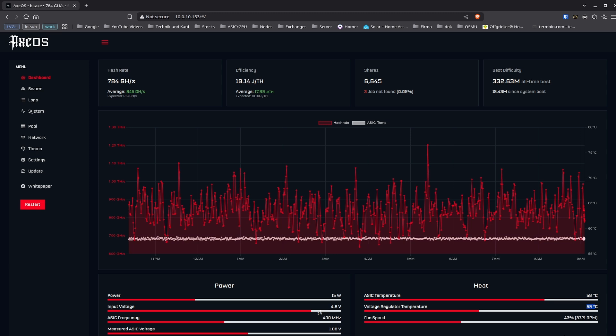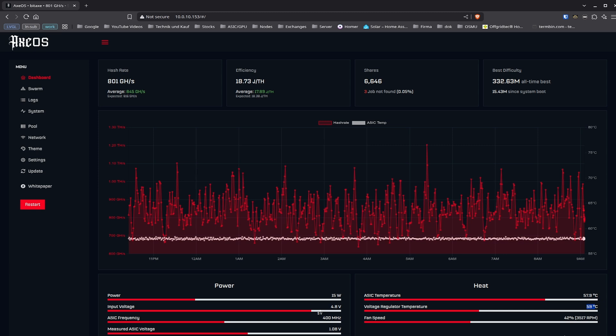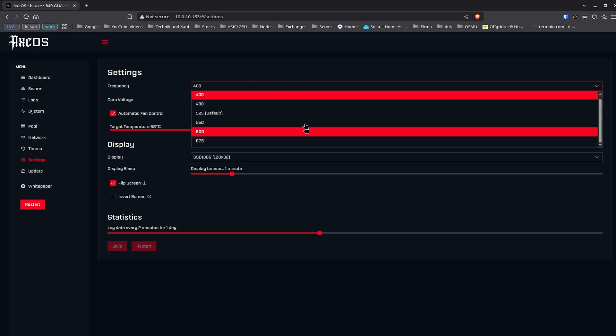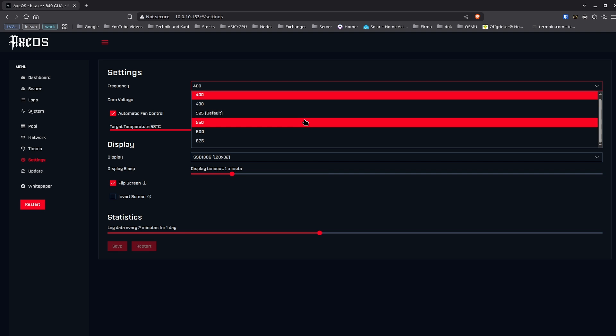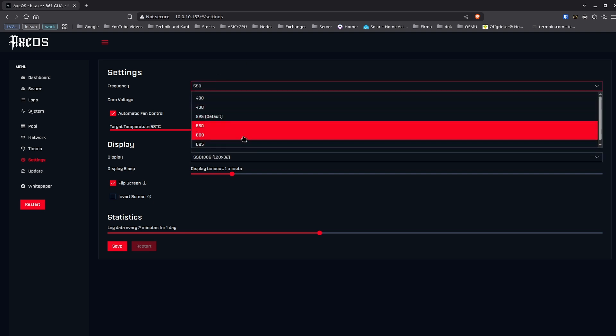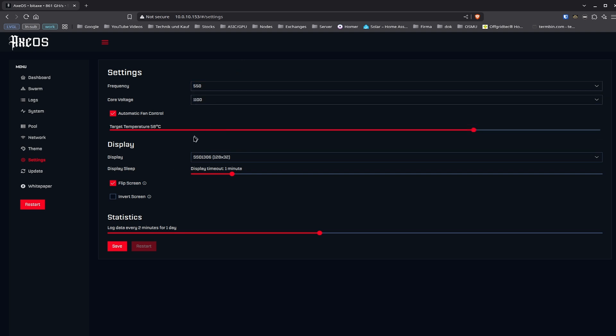You want to make sure the ASIC and everything else stays in a range of 50 to 62 degrees. Anything above that is not really stable for excessive overclocking. With the newest firmware versions, a couple of things when it comes to overclocking have changed. Don't get confused by this UI — it's one of the beta versions we're currently working on and will be available soon. On the settings page, a good approach is to start at default values and just select the next frequency step, like 550, while keeping the core voltage the same. Start by increasing the frequency in the steps available, then watch how it performs. Not needing to increase the core voltage is one crucial factor.